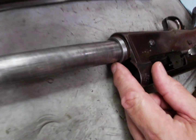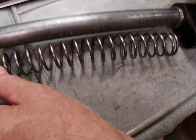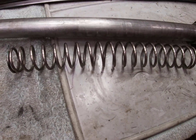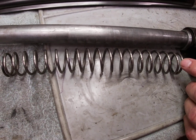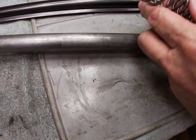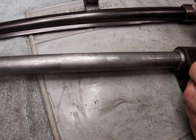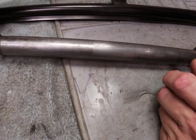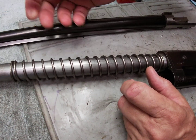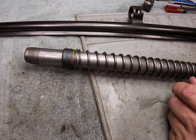As I remove the spring, you can see it's arched - laid against the magazine tube, this spring is bowed. At some point this spring has been overstressed, or somebody tried to straighten it back out. We're hoping that's not going to be an issue - we'll know when we do final testing. With the gun apart, we're going to clean off the old lubrication, re-lube it with some lightweight oil or grease, replace the spring, replace the friction ring, and put it back together for test firing.